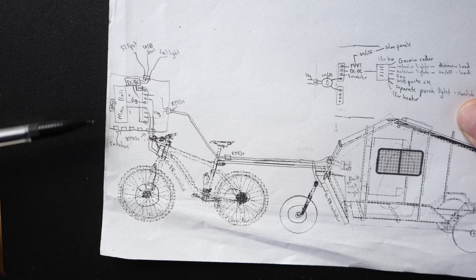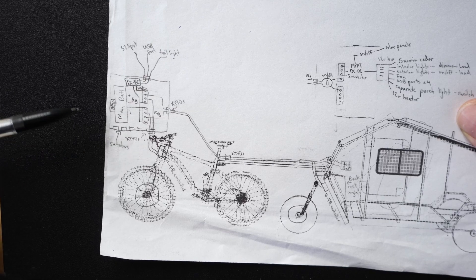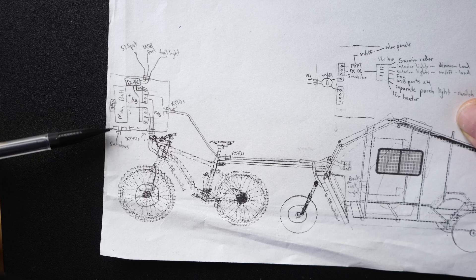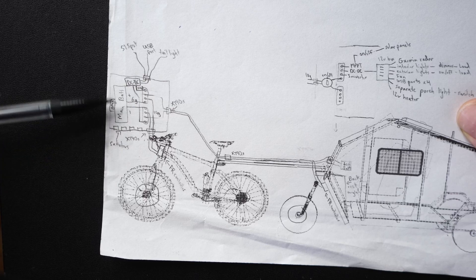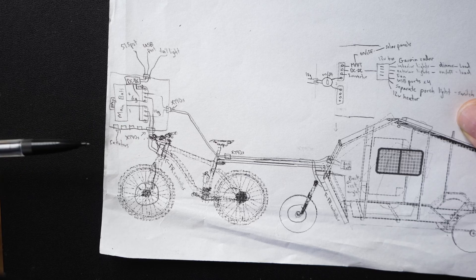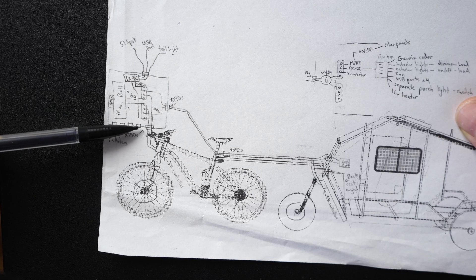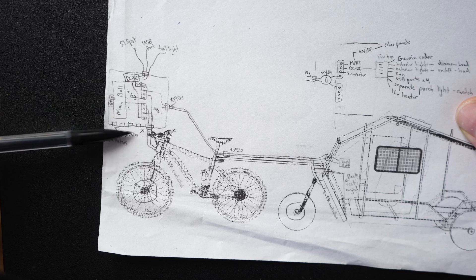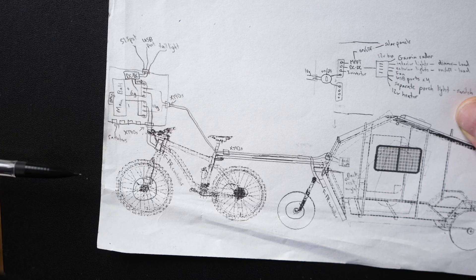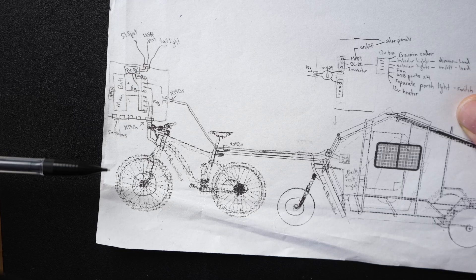To charge the main battery, I plan on using four cycle satiators from Grin, connected in parallel. I should be able to charge this big battery overnight in an 8-hour period using a typical 110–120 volt standard household circuit on a 15-amp breaker. I'll mount the cycle satiators on the inside of the box, and then there'll be a plug. From my experience, it's not hard to find an outlet with power out there on your travels.